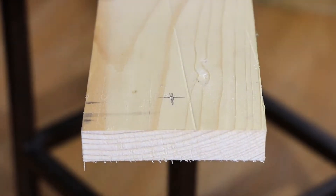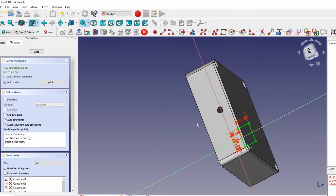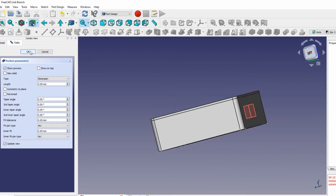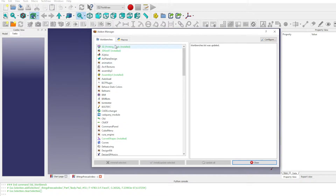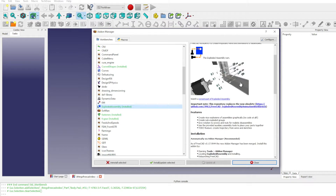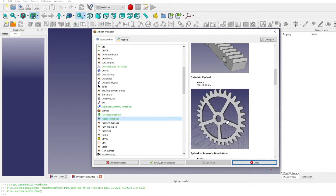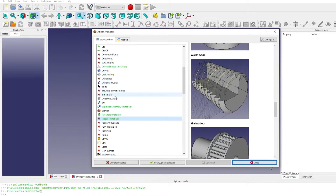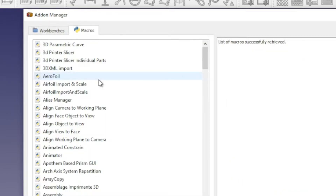Just imagine yourself in a big garage moving from workbench to workbench until your CNC 3D-printed laser-engraved part pops out finished and ready to sell. The workbenches take time and focus to master, but once you get the basics down you'll be able to start poking around and trying new things. The add-ons feature is incredible — go to the Tools tab, then Add-ons Manager. This is where you can find other workbenches that make your life much easier, such as gears, airplane wings, or tools to attach parts together or create an exploded view. I suggest starting with a gear or fastener add-on first. In the add-on menu you'll also notice a macros tab — those are Python scripts that automate work, but consider that more advanced for when you're just starting out.